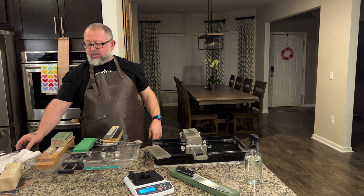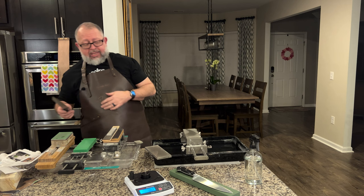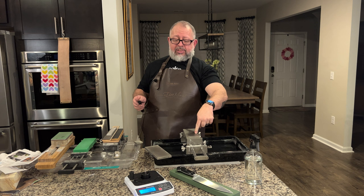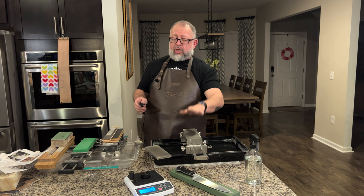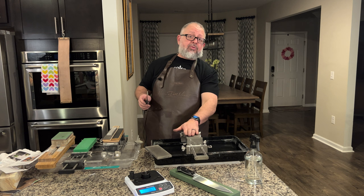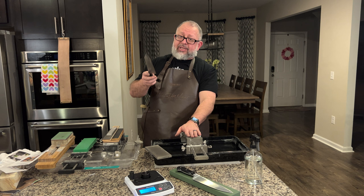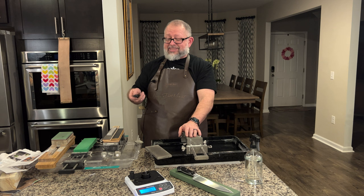With the 1200 and some stropping, we got a very hard HAP 40 steel that we deliberately dulled down to a sub-200 BESS score. You definitely need to strop afterward to fully refine the edge. It came to us around 166–168. If we'd had access to a finer CBN — like 3000 or higher — we might have gotten closer to factory sharpness, but the results at 1200 are impressive. Takeaway: lasts a long time, handles every type of steel, doesn't dish, costs a little more, and has a grit ceiling around 1200 due to the electroplating process.